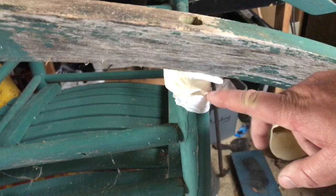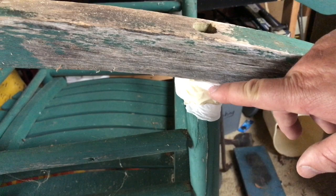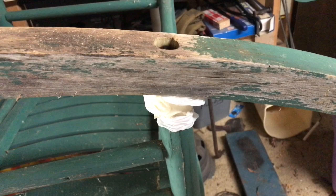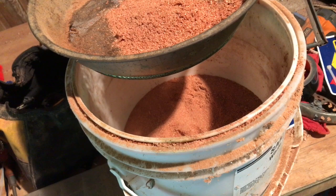This is an heirloom — well, I'm just treating it as if it was, because I'm sure that's why you're here. We don't want to mess up granny's rocker. So I put a bunch of toilet paper up under here and used some masking tape. I'm going to have a lot of glue in here, so when that glue starts to seep out I want this toilet paper to absorb it. I should be able to get this toilet paper off without too much difficulty — that's better than having to fight the entire run of glue down this leg.